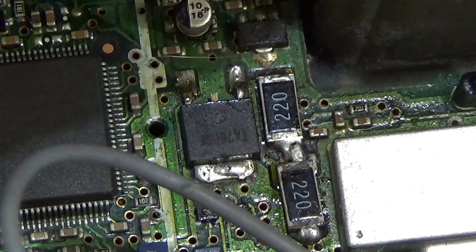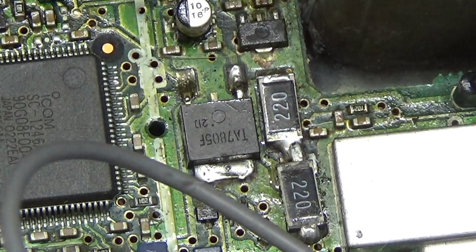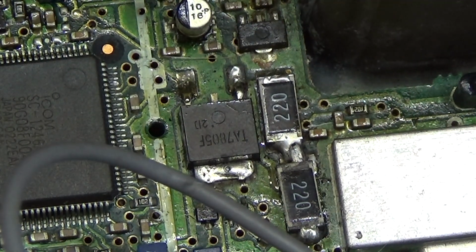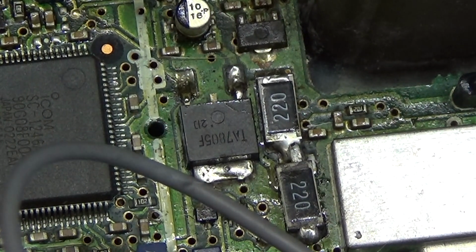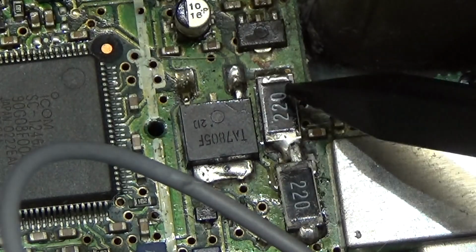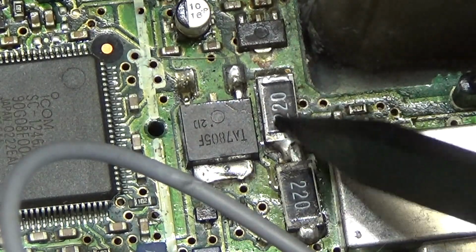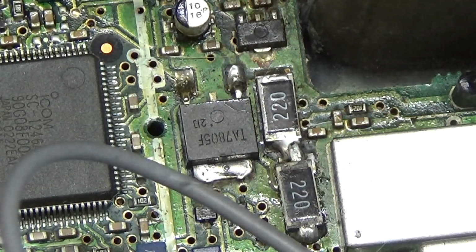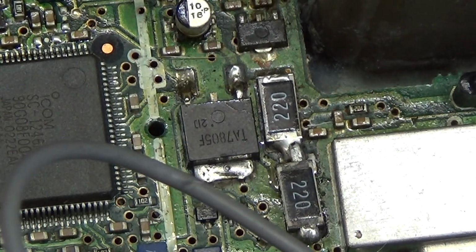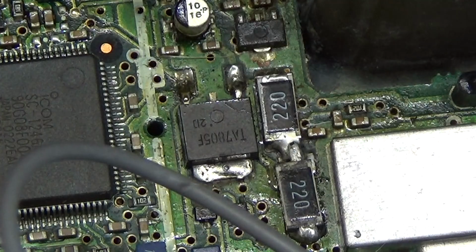And when you look here from the side at these resistors, you see that there is a gap under the resistor, which means that it is not completely lying on the surface. And that all is telling me that somebody was in and was not really able to handle SMD technique. I don't know why somebody already was in, so maybe somebody else earlier has done a repair attempt, or I don't know, but it is very, very obvious that somebody already was in.